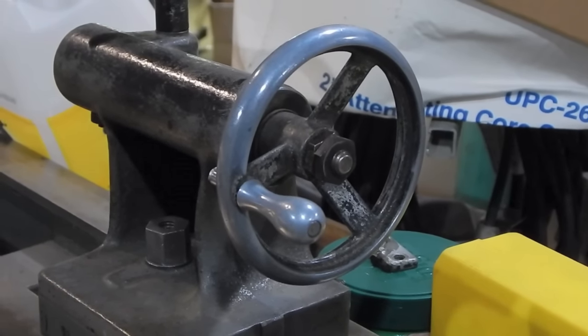So I set it to three inches just for the heck of it, and yeah, it goes underneath — which makes sense because I said this was about a thousandth under. So I'm going to set this to an inch and a half. Technically I should be setting it to half a thou under. That's a lot closer to that little center dimple than what I had before — that's what I'm going with.